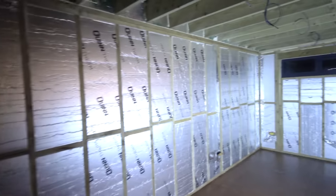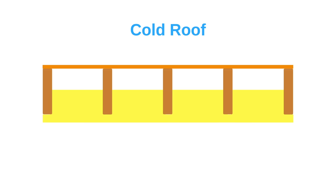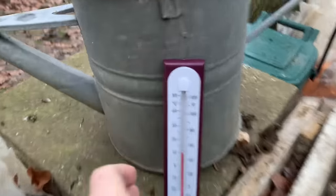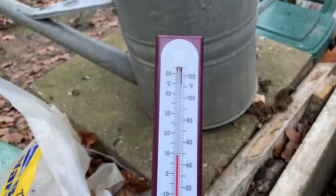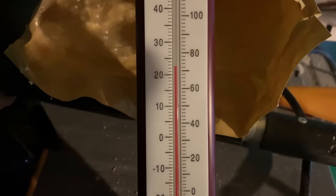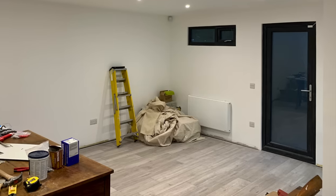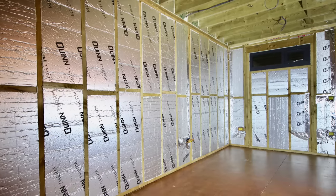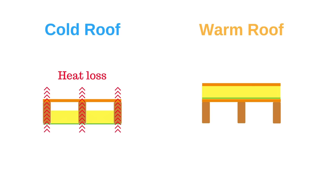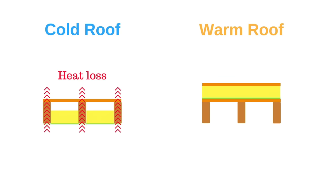That's all the thermal insulation taken care of — or is it? We've discussed thermal bridging before, which is the process of heat being lost through your joists or studs. What you can do is overlay 25 or 50mm insulation inside of the studs to create a continuous sheet of insulation. You can achieve the same thing with insulated plasterboard, but is the cost, time, and internal space lost worth it? I conducted a little test comparing the outside temperature of 9 degrees Celsius with the inside using a fan heater, and despite the window being slightly ajar the inside temperature got to over 20 degrees. Jumping ahead, my radiators are seldom on and keep the temperature at a constant 21 degrees, so if you copy what I've done, there is no need to overlay any extra insulation. Timber is actually a very good natural thermal insulator due to having air pockets within its cellular structure — 15 times better than masonry and 400 times better than steel.